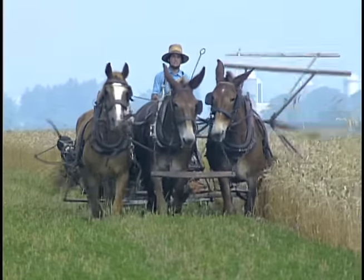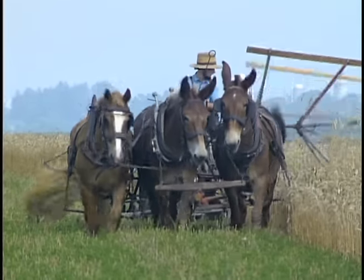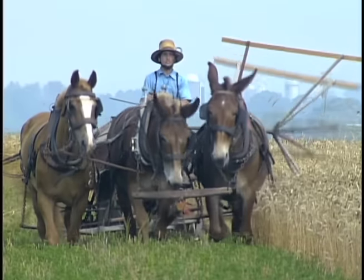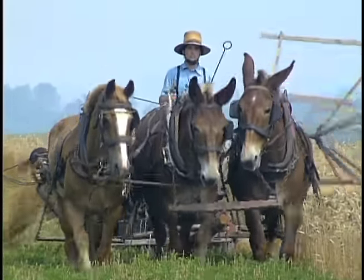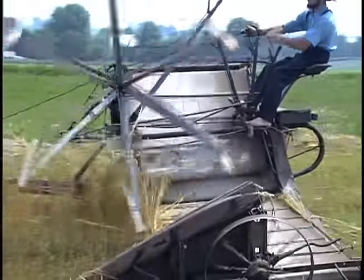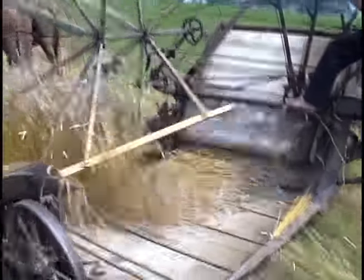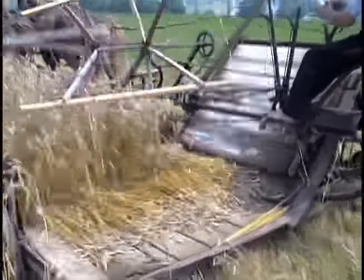These were the machines that were used. Every farmer had a grain binder, or two farmers maybe went together and had a grain binder, and you could cut a lot in a day. 6 feet, 5 feet cut, some even went 8 feet cut. It has a sickle bar which cuts the grain. Now your big paddle rack here makes sure that your grain lays down nice and even. Otherwise, after the knives cut it, it would fall either way, where this paddle wheel just lays it down.